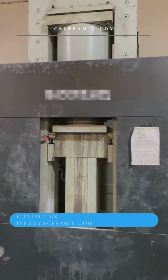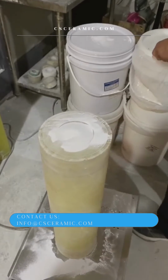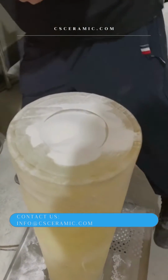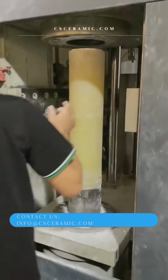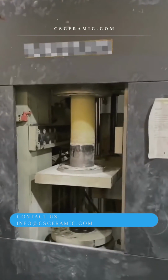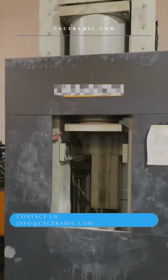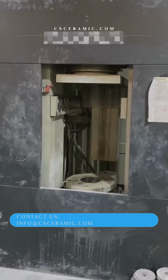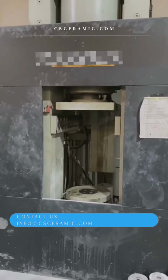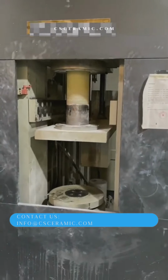Dry bag type isostatic pressing of ceramics is to fill the ceramic powder batch into a flexible pre-shaped rubber film, half-fix the elastic mold, not soak it in a liquid medium, but seal it with upper and lower pistons. The pressure pump injects the liquid medium into the high-pressure cylinder and pressurizes the rubber, and the part is formed by liquid isostatic pressure.